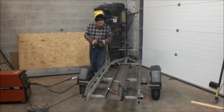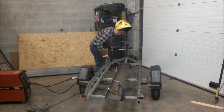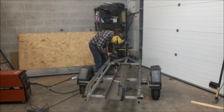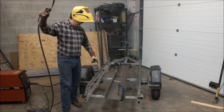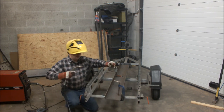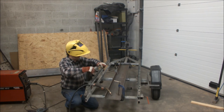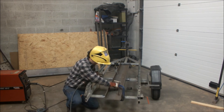It would of course help if I put the earth clamp on. I put it there on purpose - so I forget it. That was a test and a fail! But always trim back the wire. Let's try again. So I've got two tacks at that end. I've got a clamp there, so I'm going to run a weld in here and see what it looks like. First things first, I'm going to clean the end of the nozzle out - any splatter that's in there, let's get rid of it. This galv, if you haven't got it all off, it does tend to really blow back at you - it's not very nice stuff at all.